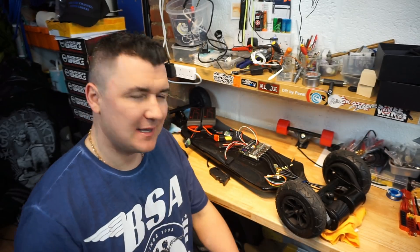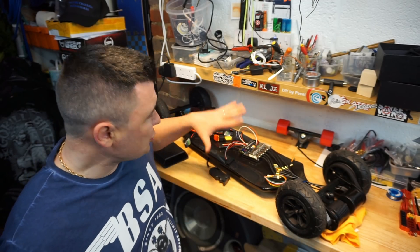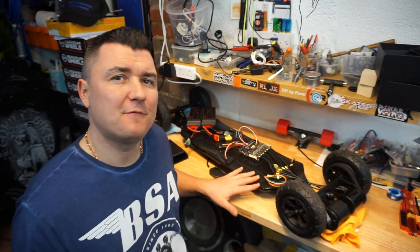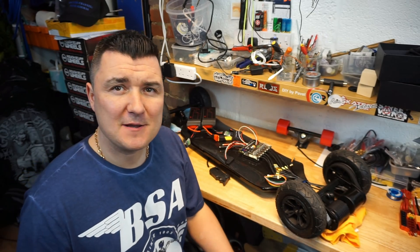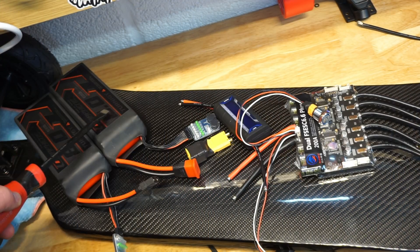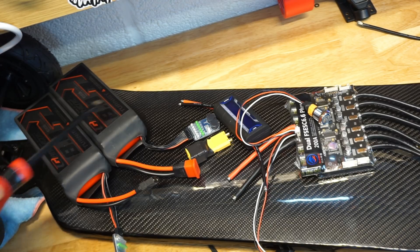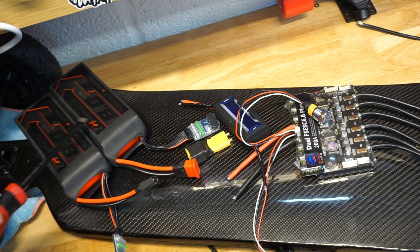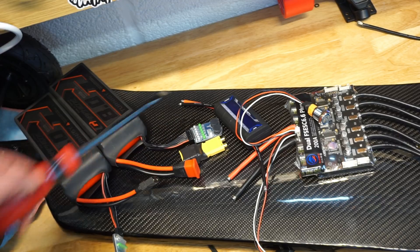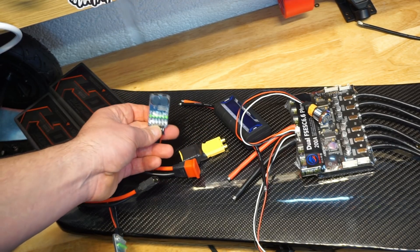I'm cleaned up and my desk is cleaned up. So let's take a close look at what you're going to need to complete any electric skateboard on the electronics side. In this instance, I'm building a custom carbon fiber deck, custom trucks, custom motors, custom everything, with a real interesting way I'm going to mount my battery. Everything starts with two 8000mAh 10C LiPo batteries, 6S each, for a total of 12S. In order to become 12S, I'm going through the series adapter. On the balance charger cables, I will have the low voltage alarms.